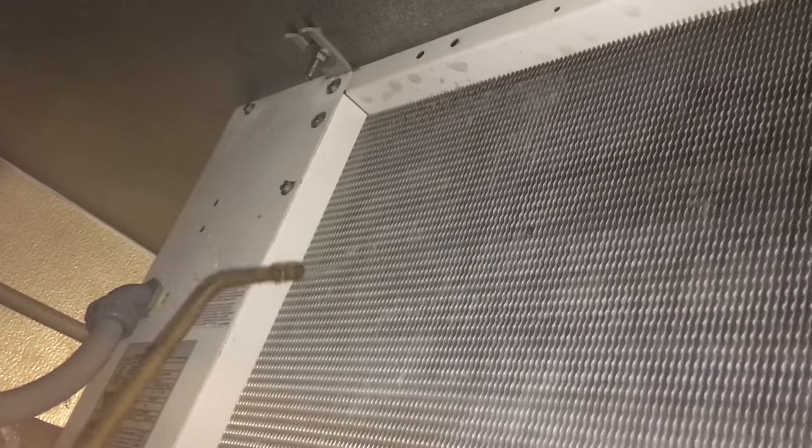The thing is coming out pretty good now — you can see all the dirt is off the tubes and that evap should be pretty damn clean. Like I said, I've been cleaning this thing every six months for the last three years. Just keep vacuuming it and hosing it with water. If you stay on top of it you can keep these things clean and they'll work good — they'll clean up real nice for you.